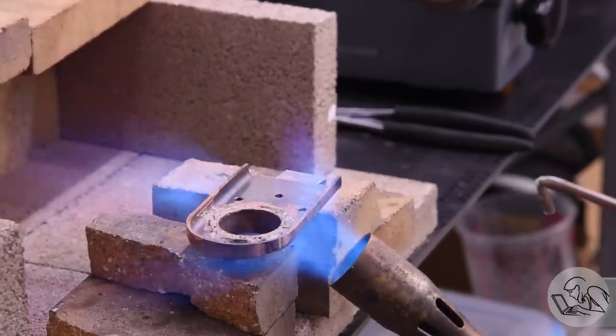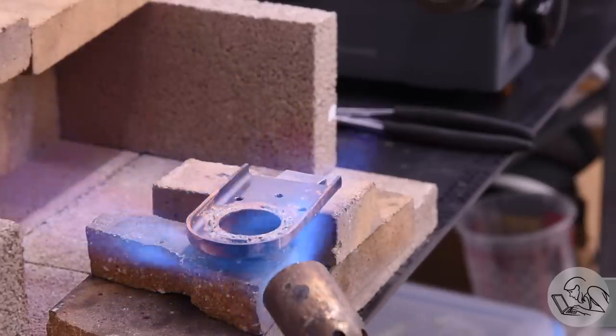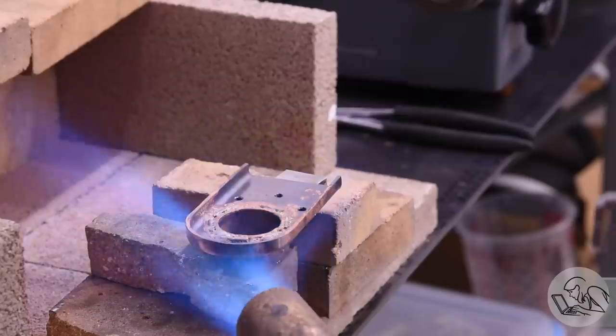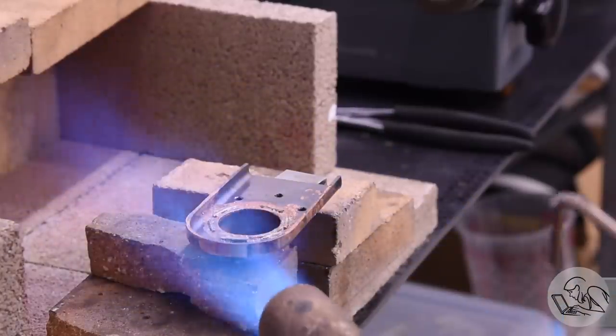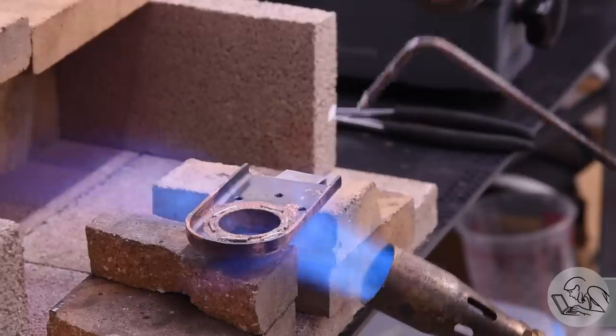Then once that foam gets a little hotter, it starts to melt, and the foam melts down into a clear liquid that looks just like water. And that's the moment where the silver solder is just about to flow. So the flux tells you what's happening. The trick is you should get to this point in under 5 minutes, preferably 2 or 3 minutes.